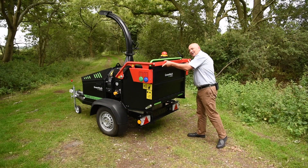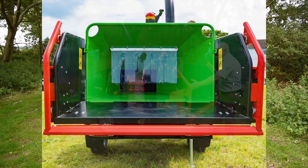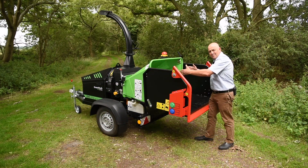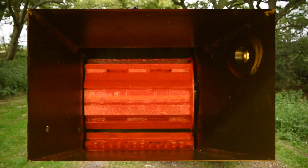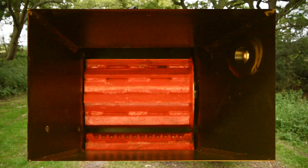One of the things I like about this machine is there's no compromise here. We've got a nice wide opening in combination with horizontal rollers going down to a 220 millimeter wide throat. The horizontal rollers gather and grip the material whilst offering a smooth flow into the processor with reduced lateral movement of the timber.